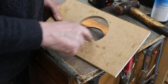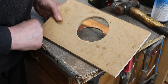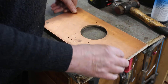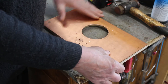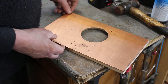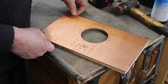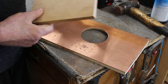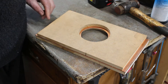I've made it the diameter of the barrel plus the thickness of the material. I've put in a couple of pins to locate it. The material has been supplied cut to exactly the finished size, so it's important to have these pins in to accurately locate the material in the predetermined position each time after annealing. For the clamp plate I've again just used MDF, which I'll clamp onto here and we'll just see how it goes.